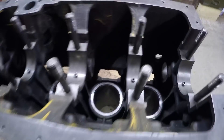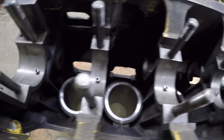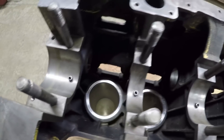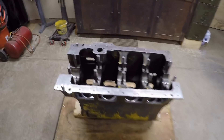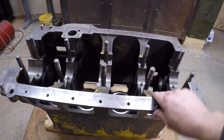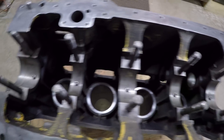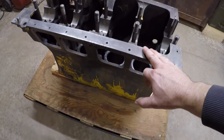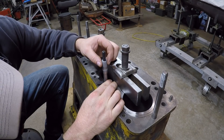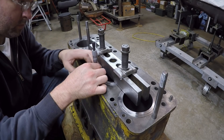With the liners in, I flipped the block upside down. It's sitting on a nice two-by-six down there keeping good tension on those liners, and this is how I'm going to start assembling the insides of the crankcase. I like to see that shiny metal down in there. Since I don't have an engine stand capable of holding this block, I'm just going to leave it sitting upside down — it's plenty solid. Before I flipped it, I did clamp that puller bar onto the tops of the liners and did one last protrusion check to verify none of the readings had changed, and they didn't. Everything still looked really good. We've turned a corner — we're starting to put all the parts back in. This concludes episode 3; stay tuned, episode 4 is on its way. Thanks for watching.